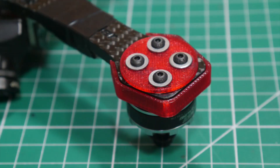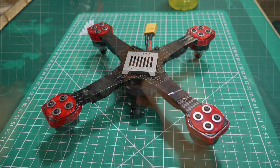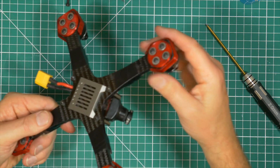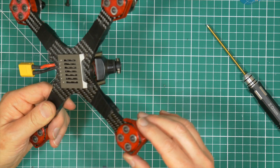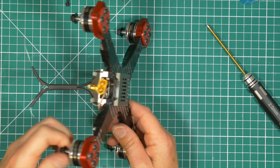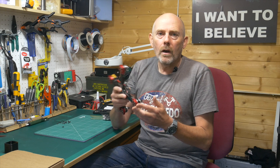So there we go — a nice way of soft mounting your motors and protecting the edge of your frame at the same time. I did weigh all these beforehand — it's about 12 grams for the weight of all four top mounts, bottom mounts, and washers. The bolts you would have those anyway, so you're adding about 12 or 13 grams to the weight of your quad, which isn't ridiculous. I found these really helped reduce that final bit of prop wash oscillation I was getting, particularly on flat vertical drops. The new 2017 GT2 model seems to use something similar to isolate the motors — as soon as I get my hands on one I'll let you know. I'll leave links in the description where you can buy this kit, and if you have any questions leave them in the comments below.